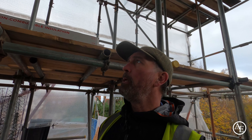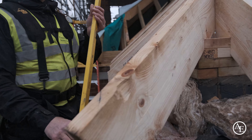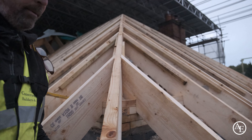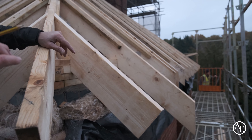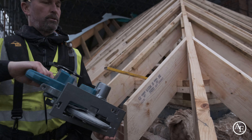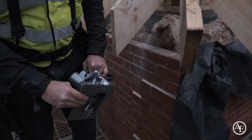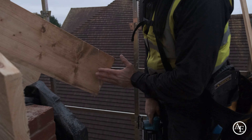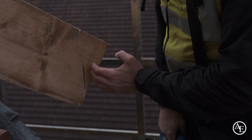So let me crack on with the rest of the roof. This small extension that we're doing now - just up here getting some 2x2, start making some framework up. It's a little bit more difficult. I'm just sliding this through, cut that off like that and then I'll just plumb that down - a plumb cut on my saw at 45 degrees. Then once I've done this, I'll measure halfway and obviously this cut here will come on the return like that. Most of these are actually done because the way all of the mono trusses are marrying up. I'm going to set this now to 45 - the great thing about this saw is that you can go to 53 with this. You can see the blade started to bind because of the way the timber slightly cambered, so all I did is just do a lower cut and then made it wider so as the blade was going through it stopped binding on the back of the blade.